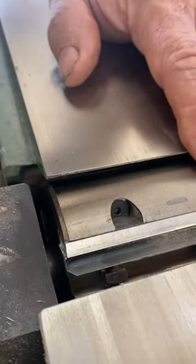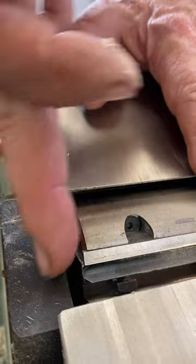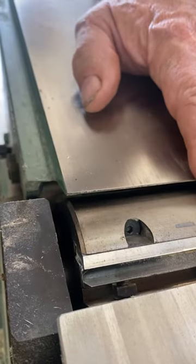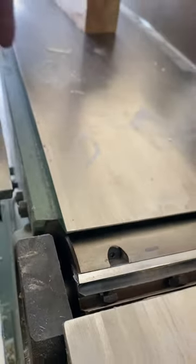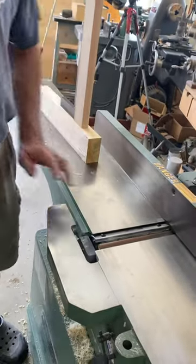English machines will generally have that machined. You don't need a scriber — you just need to grind the end of those knives at 10 degrees, which is sufficient as it's just for side clearance, and that's what does the rebate.